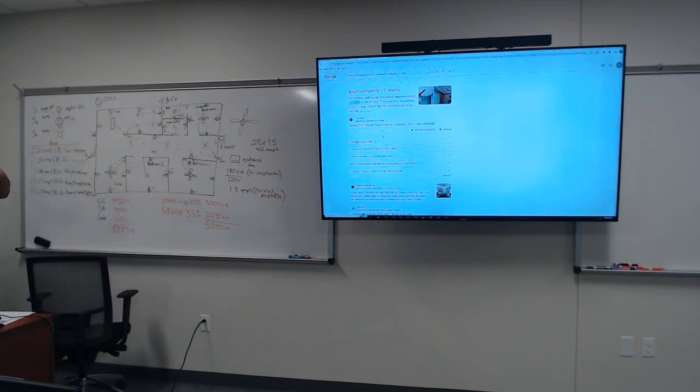But I'm giving you the concept that later on, we could probably put lights on these breakers that we made for the plug, if we got the amount of calculated space. When I say calculated space, meaning that if it's 8.15 that we calculated for this 120 volt circuit for the master bedroom, can we afford to put more lights on that? Yeah, because we got a 20 amp circuit breaker, but they trip at 16. So 8.15 from 16, that's almost 8 amps that we have left of calculated space.